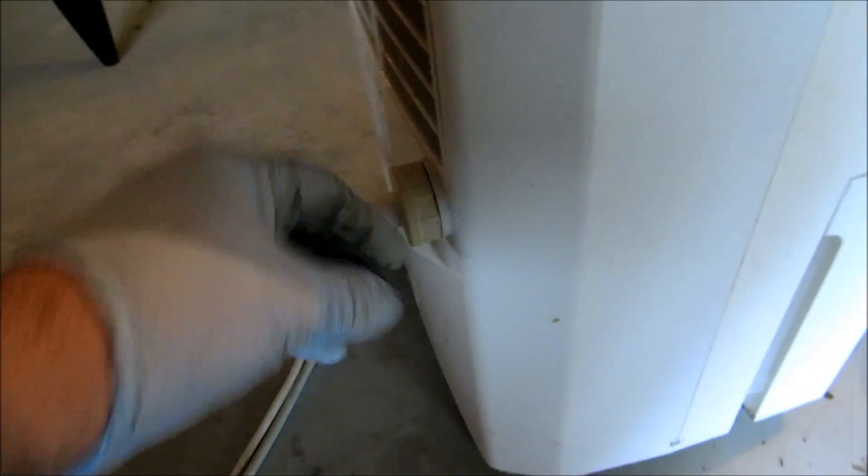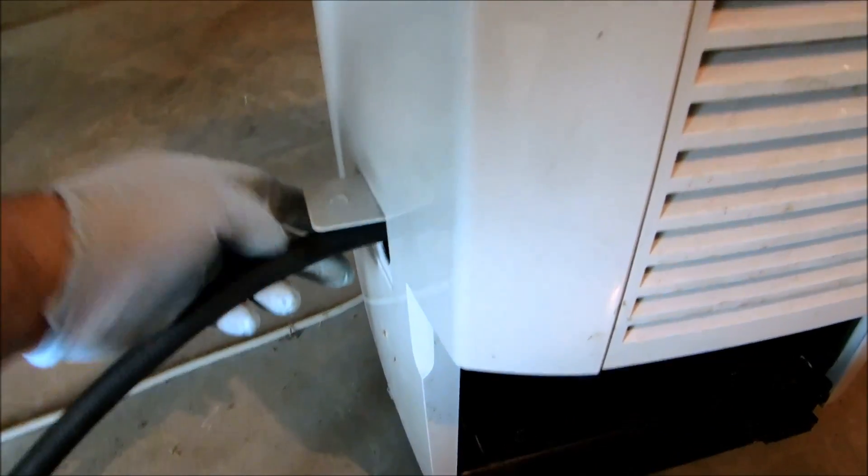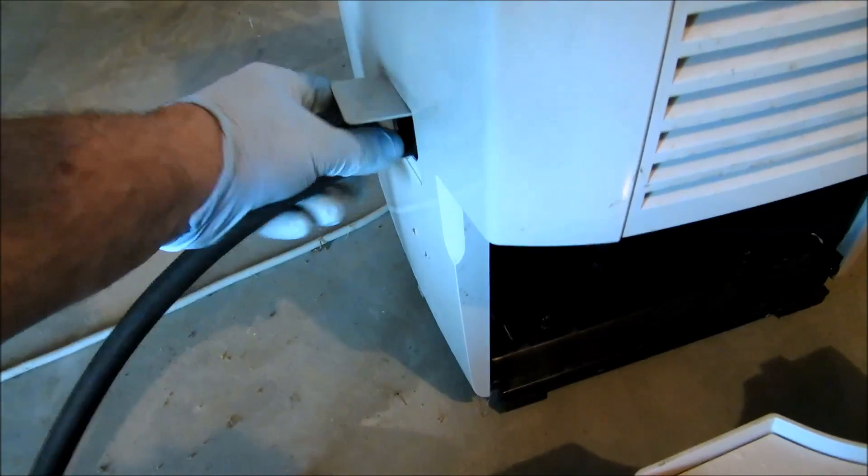Both of these run off this plug. This one here already had a hose on it — this cap here just had that rubber plug. I took that plug out and put the hose on it. On this one here I'm gonna use washing machine hoses. I took this container out and there's a connection that you just have to put in — I'll cut this hose to fit into the drain. Basically this thing will just drain and dump into here, so by putting this hose on here I'll bypass this container and it'll go right into the pump.